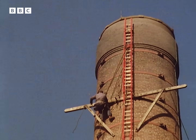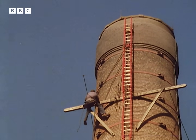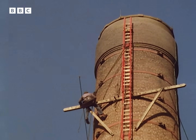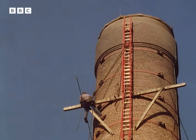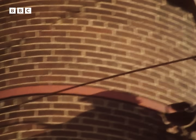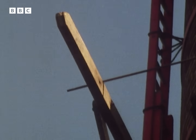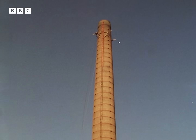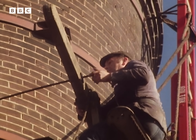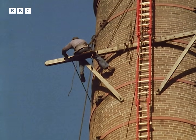All the modern men use aluminium scaffolding tubing now, but I like this way of doing it. It's a bit more awkward, but when you've got it all up, it's quite solid. When you've finally got the rods through the two sets of holes, you put the washers and the nuts on, or a few packing pieces, so you can slightly cramp them up round the chimney.